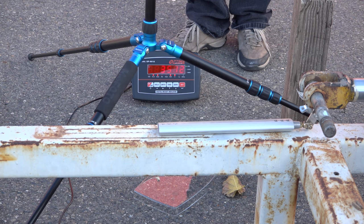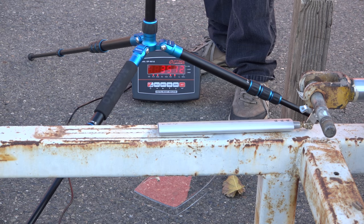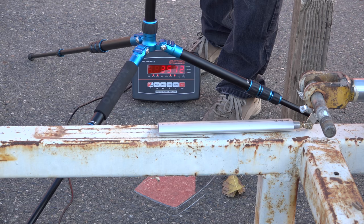How much was it? 3,512 pounds. So that's a pretty good test. And if you think about it, each one of the stainless steel pop rivets is good for approximately 400 pounds single shear. So 4 times 6 gives us 24 — meaning 2,400 pounds. Times a 1.5 safety factor gives us 3,600. So we're in the ballpark from what we actually expected on this thing.